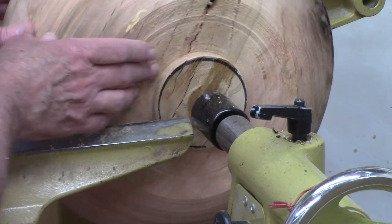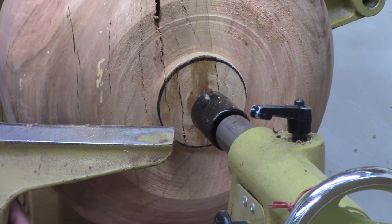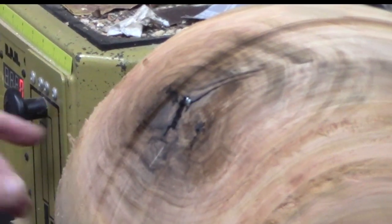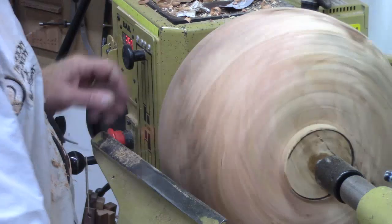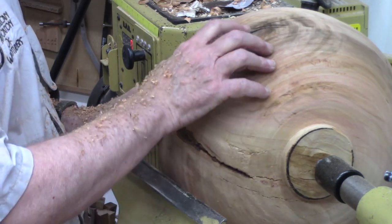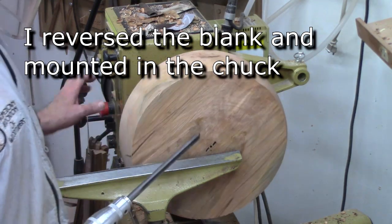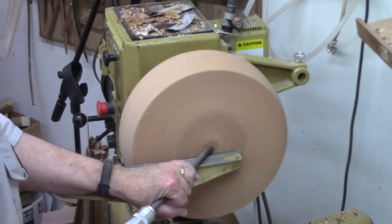That gives me a little better feel for the rough shape of the outside of the bowl now that I know where the tenon is. Got a little ant here visiting me — wonder how long he's been inside. I'm cutting into the barbed wire now, I passed it, so I'm going to go ahead and finish taking this cut and bringing it around. I think I've got the outside done. Time to do the inside. I think I may finish it with that barbed wire and call it the barbed wire bowl. Getting ready to hollow — I think I'm going to true up the face of this first. I think we've got it balanced pretty well, running about 700 RPM.